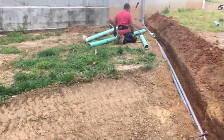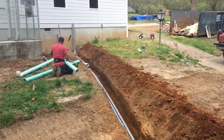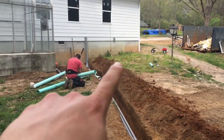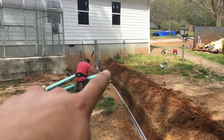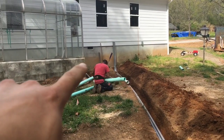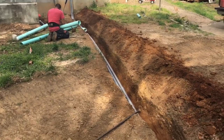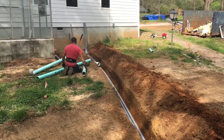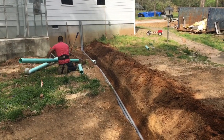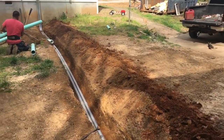The minimum fill requirement is something a lot of people ask about — how deep do you bury the pipe. We're going to be bringing in fill dirt right there, so we're not as deep in that area. You can see where the grade is and we've got to bring that back in. I'm going to cut now to the NEC minimum fill requirements and show you how to figure out how deep you need to bury your conduits and electrical wires.